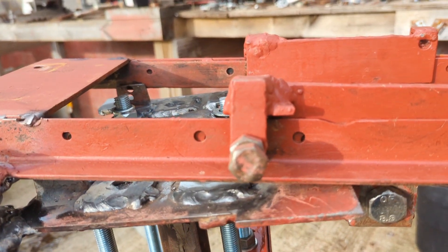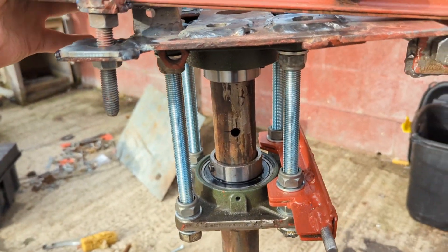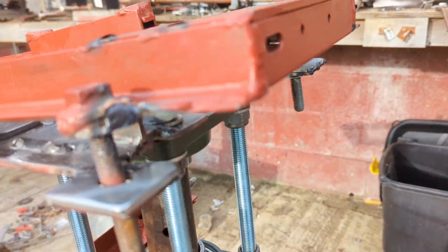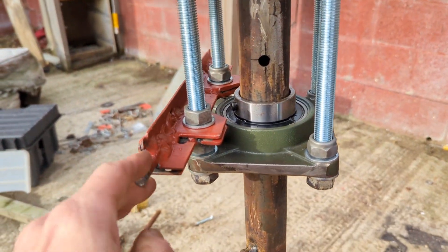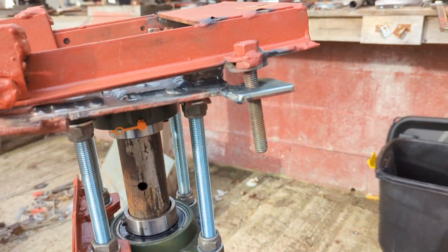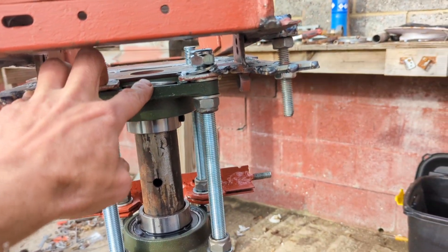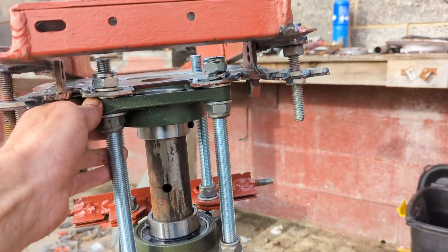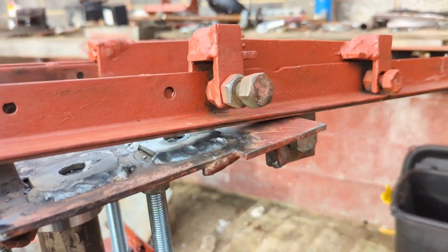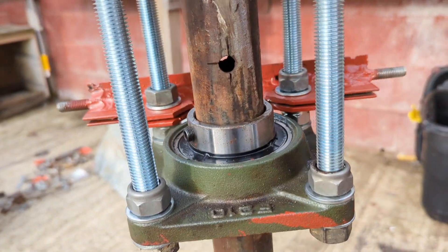Which I don't really want to do because I am planning to have the 25 kilo blades on the front. I feel very positive about it because it's so much stronger than it was — I can feel that even without the supports, which obviously go from here to the back to carry the extra weight of the tail. If there is a problem with it being level, which it looks like there is, then another washer on the left will sort that out. Let's have some likes for that — it's looking pretty good with the new double bearing device.